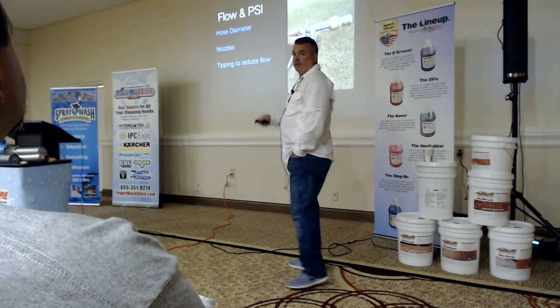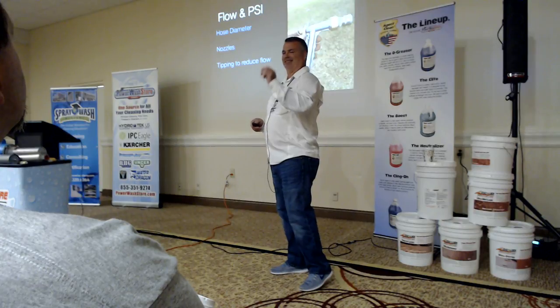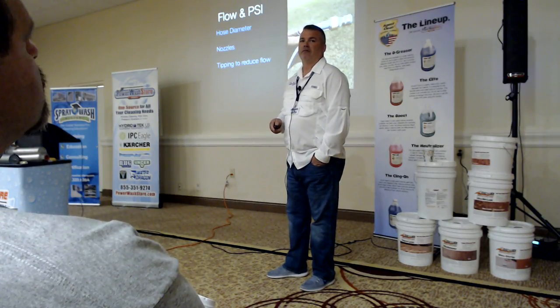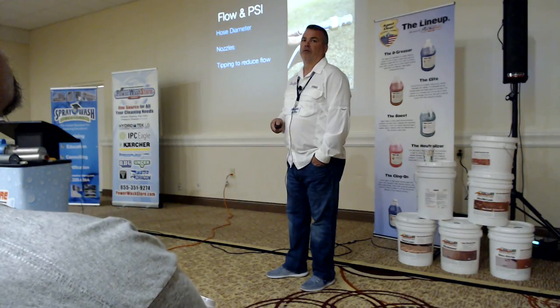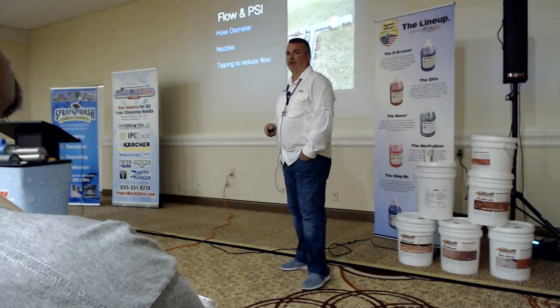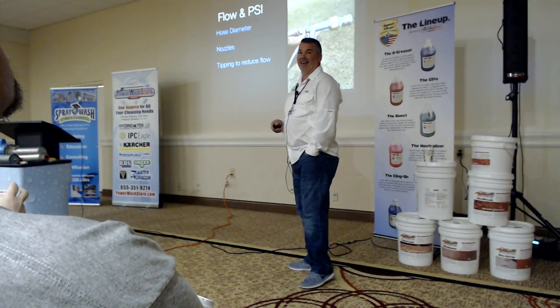Tim, real quick, if you start getting clogged tips, I think this one I own had the worst destruction of the diffusers. My guys had either debris in there and then it was tripping. And on the back end of it, you can twist it, which will get it to keep running, but it managed to destroy, I think, all but one stage. Yeah. You fried that one. Yes. That was pretty good. And it had definitely been overheated. It was not my fault. It was my guy's fault.